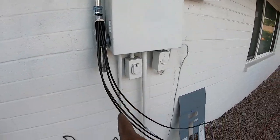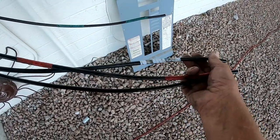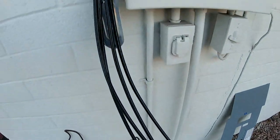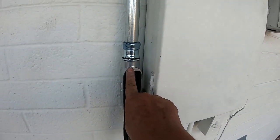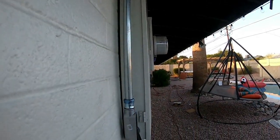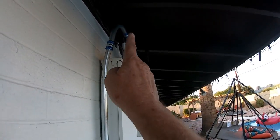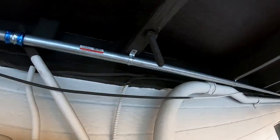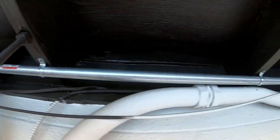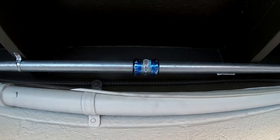Now the black, the red, the white, and the ground are all coming out of the conduit. It goes up there and it's very even all the way down. For the ones up there, I measured from the edge of the eave overhang 43 inches, and that's where I put my first screw. I put my hangers like that — two at the beginning, then skipped two, and put another one. Right here are my rain tights, which keep all the water out. That is required by code.